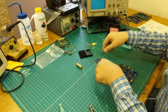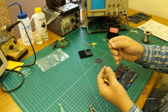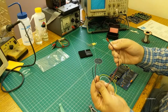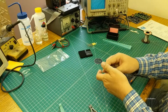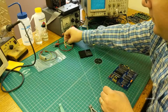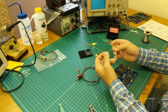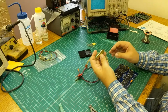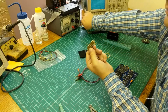The manual contains instructions on how to put together your serial pigtail, and of course your power pigtail just needs the end stripped and hooked up to a 5-volt supply. We recommend using a supply that can do at least 500 milliamps if you don't have any glitch bus boards or anything hooked to it. More boards means you're going to need more power. We already have a set of cables made up, so we're just going to use those.